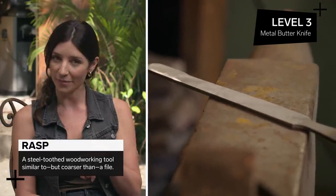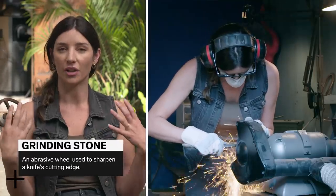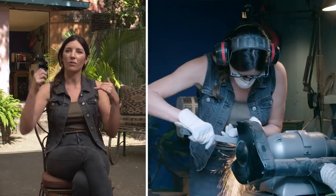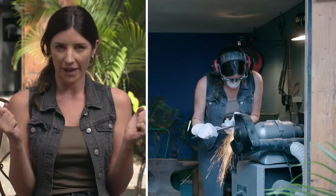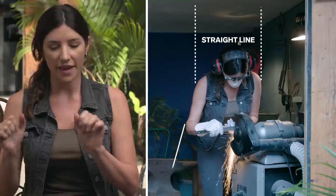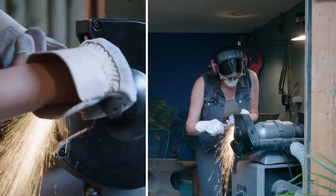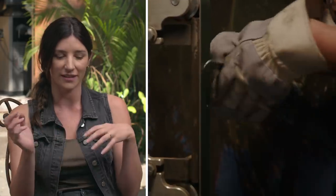To make a metal butter knife, you will source the material. What I like to use are mechanics rasps — I'll find a rasp, trace out the shape, and then use a grinding stone to rough out that shape. So much about working at the grinding stone is about posture. If you're standing there for hours a day, you wanna make sure that you're not overworking your body. You're using a lot of force, so keep your elbows in, keep a straight line so that you've got a lot of movement and you're not too rigid, and let the material really guide you. Unlike working with wood, where it wants to take your lead, the metal will really control you. Once I've ground out that shape, I'll use a series of sanding belts to bring it down to just the shape and thickness that I like.